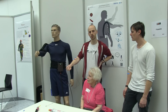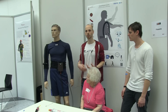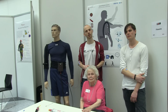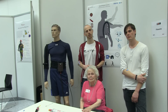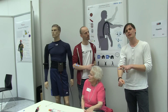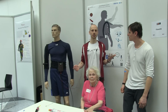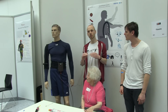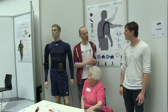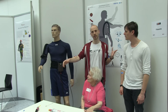So you have several ways to control it and set it up for your own arm, or for whatever you attach the electrodes to. Let's try an experiment — you do some movements and he has to replicate them. The thing is right now we've put it on a muscle that doesn't control the lift movement of the arm, but if you move your arm I can try to follow. There's a bit of lag because the smoothing algorithm is not set up in a very good way yet, so we do get a delay. If I tighten the muscle completely right now, that's how fast it works.